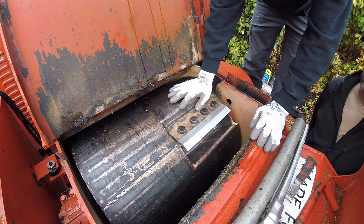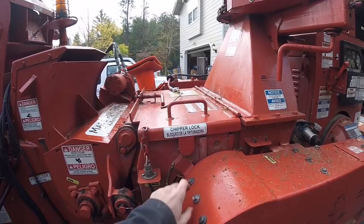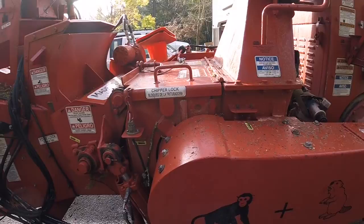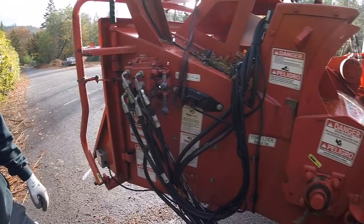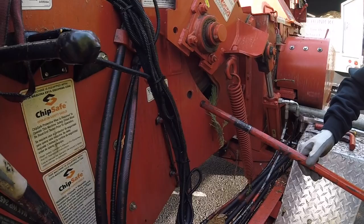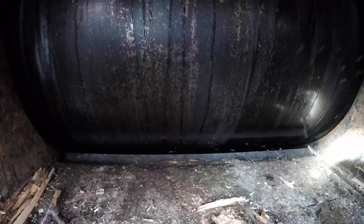Afterwards we'll look with our eyeballs at the knife clearance against the anvil. The bolts are snugged up, we have the safety mechanism back in place. Make sure the clutch is disengaged, which controls whether the knife drum turns. Then we will raise the feed drum and lock it in the up position with this lock bar. Morbark won't let you lift the knife drum door with the feed wheel up.